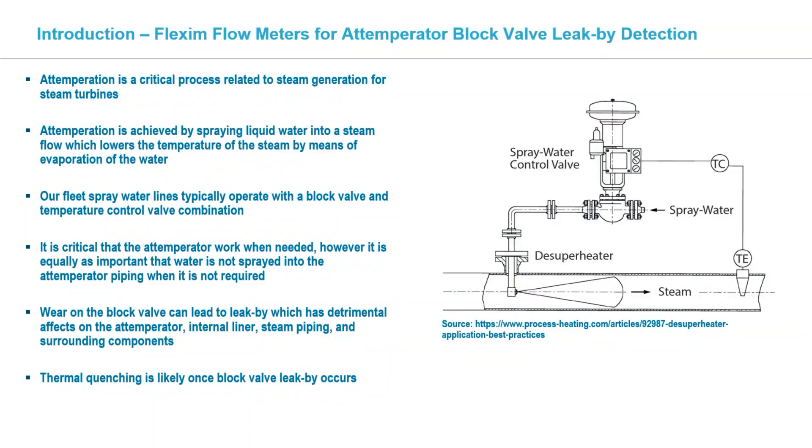The blade tolerances are pretty tight, so you want to keep things consistent going to the steam turbine. We do that by taking condensate from the boiler feed pumps and injecting it. There are different types of temperators; our primary type is the ring style. We have a lot of CCI and Fisher equipment on our unit — the ring style with spring-loaded nozzles, with anywhere from three to six spray nozzles circumferentially around the steam pipe, requiring a long distance downstream to evaporate that spray flow. Our typical configuration has a temperature control valve and a block valve upstream.